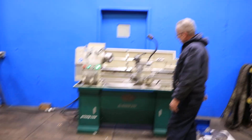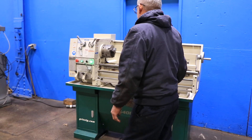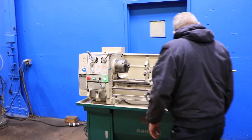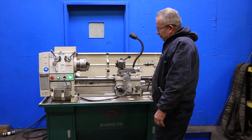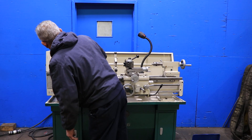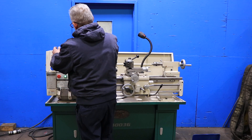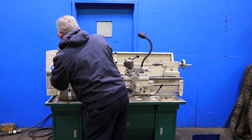It's running right now. You have from 70 up to 1,400 RPM. She's nicely equipped with a three-jaw chuck, four-jaw chuck, steady rest, follow rest, quick change tool post, face plate, drill chuck, live center, and thread dial indicator. Nice little package. You have a D1-5 camlock spindle with 1.57-inch hole through.